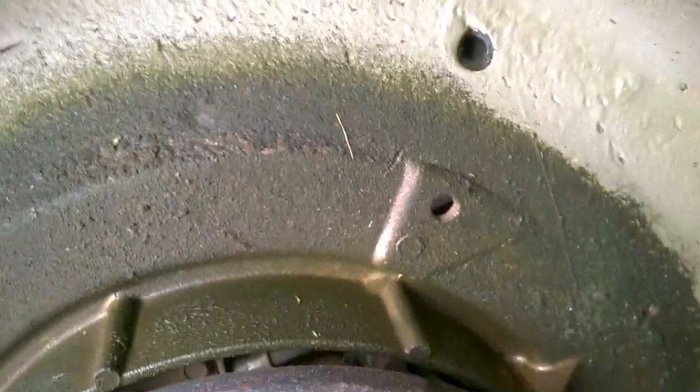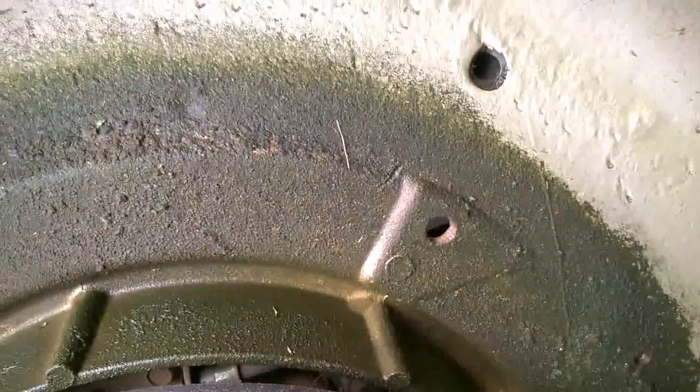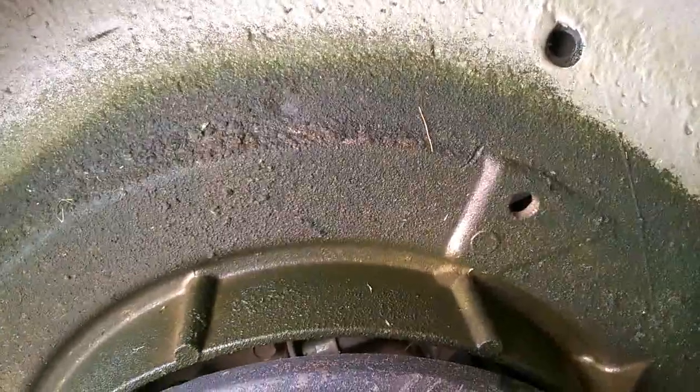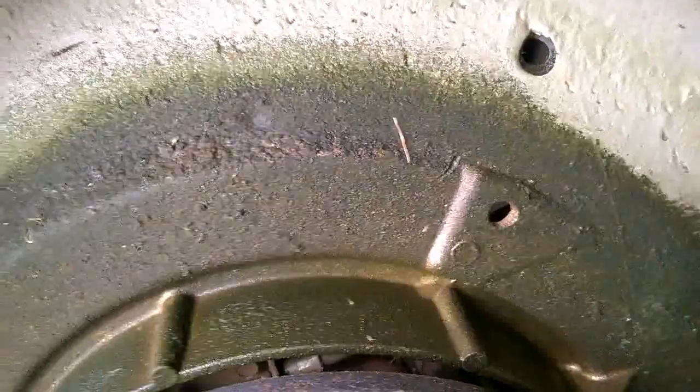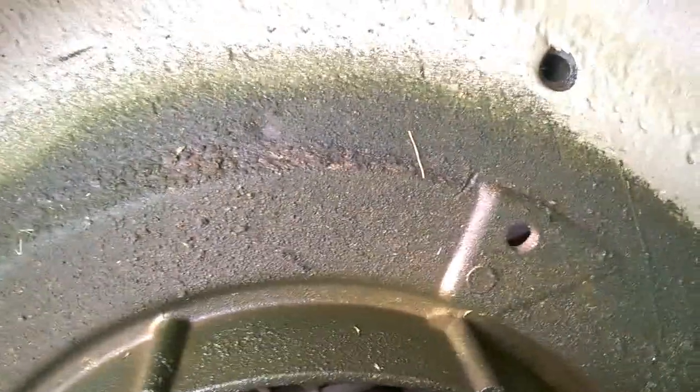You can see the holes there. That's pretty clean there, but I'm going to have to clean this off. Now I'm going to use Maxi Bond to bond the rubber to the alloy. I figure that the Maxi Bond dissolves in turps, so I'll clean it with turps. So hopefully there's a good bond there then. Alright, so make a start.